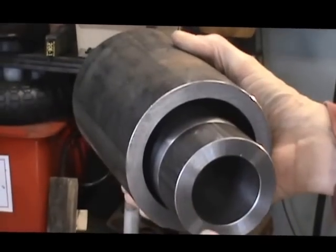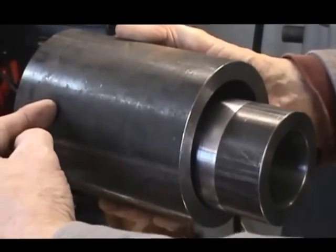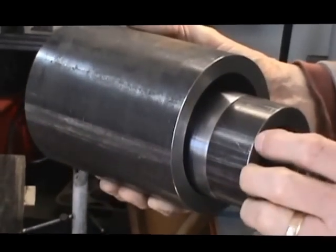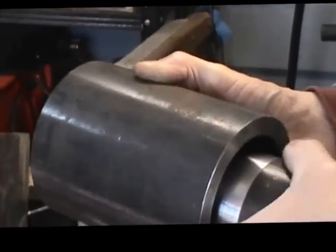We're going to have a lubrication point on the end of this shaft, and we're going to have a lubrication point coming through this piece of the pulley, and we'll be able to, with our grease zert fitting, introduce the grease for that to ride on.